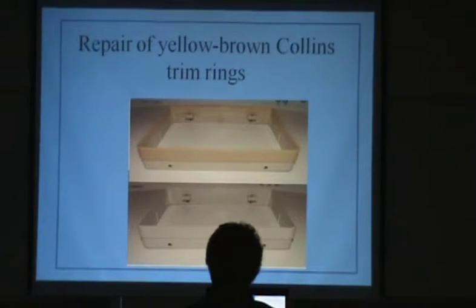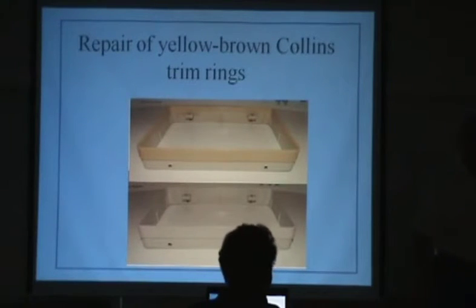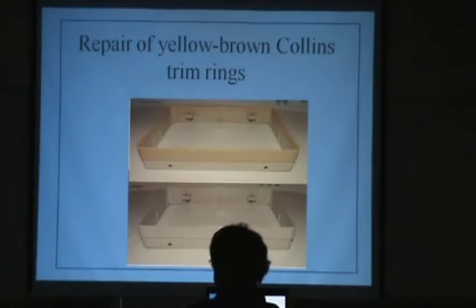Now, this is a trick and a half. Found this on the CCA site. Hot diggity dang. How many of you boys out there have a piece of plastic that has gone brown or yellowy brown? That's because, you remember in the early days they did pictures on acetate? Well, now and then they'd have a big fire out in California and Hollywood and burn up billions of dollars worth of wonderful old films. So they changed the composition and all that. When they went to plastics, as you remember the first X years with the KWMs, and I'm sure Jim could tell me the year they quit, they went from using an aluminum ring on the front to a plastic ring. The plastic rings do that. Why? Bromine. That's what they put in to make it a bit of a fire retardant. Don't know why anybody's worried about a KWM2 catching on fire and burning the place down, but they did.